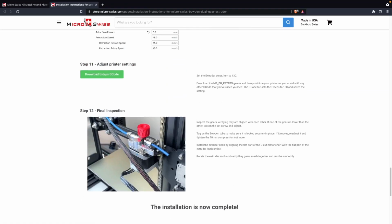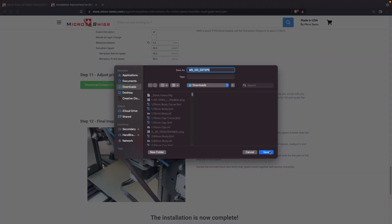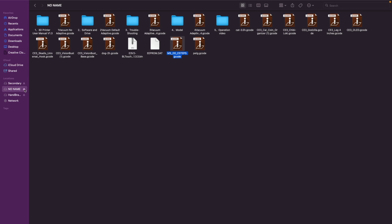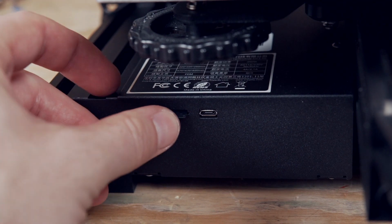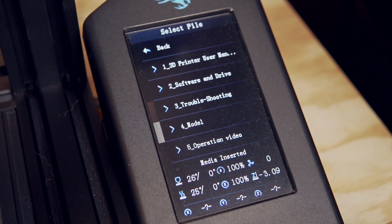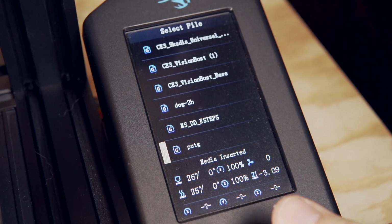The last thing we are going to have to do is update our E-steps. MicroSwiss made it really easy, and if you just go on their install page, which I'll have linked in the description, if you click the download E-steps, it will give you a G-code file that you'll need to transfer over to your printer's microSD or SD card, plug it into your printer, and navigate to that file and just print it as you would any file, and it will just instantly update the E-steps on your 3D printer.